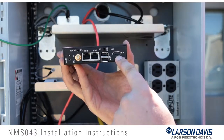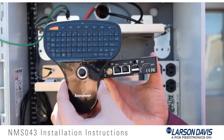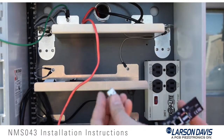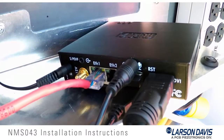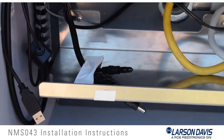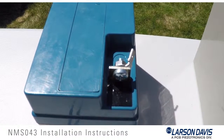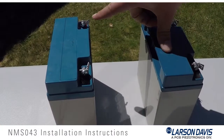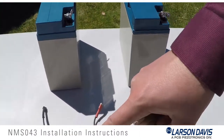In this step we will be placing the station PC on the second shelf and attaching the associated cables that are taped to the second shelf. Looking at the back, you need to connect the power connection, the Ethernet connection, two USB connections, and the HDMI. One of these USB connections comes from the dongle for the wireless keyboard and trackball. On the third shelf, there are auxiliary power lines for the SEN-031 weather sensor or other accessories.